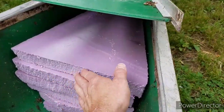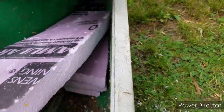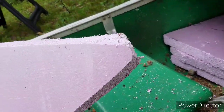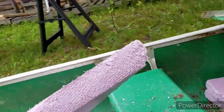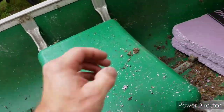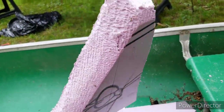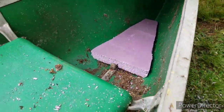I'll put up a stack of these triangular pieces like that, and then when the hull starts to get a little narrow here, you just take the surform and shape them in a bit. As the hull gets finer and finer, you just keep shaving them off finer and finer to fit, down to this very bottom piece. That fits right here in the bottom and gives it a good base.